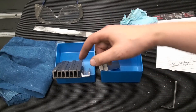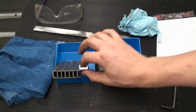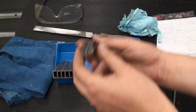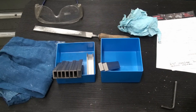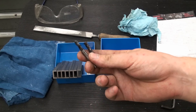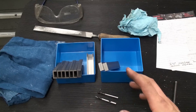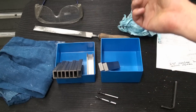First I tried a 10 millimeter wide roughing end mill with the corncob-style serrated cutting edges — that didn't work at all because it pushed the part out of the vise as I cut the channel. The sections were not stable enough. Then I changed to a 6 millimeter corncob roughing end mill, which worked better, but these are high-speed steel. Even if coated, you can't run them long in stainless without coolant, and I want to do dry milling because it's more convenient.